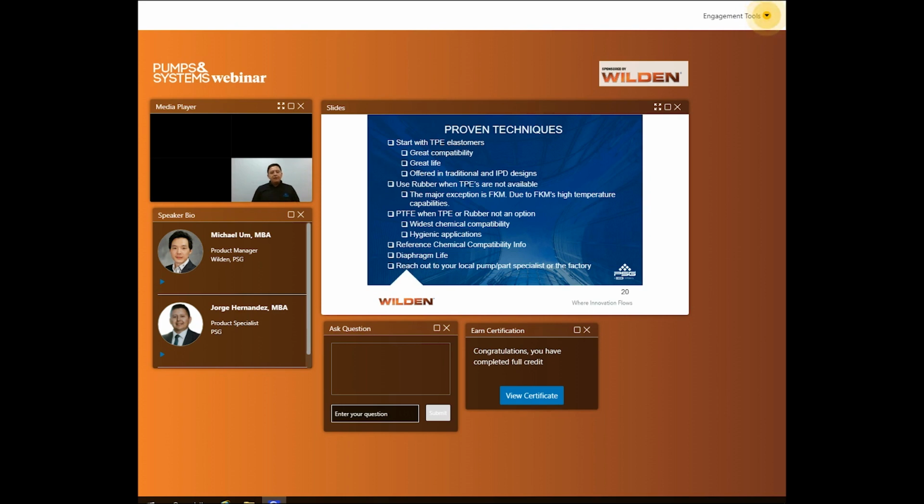The PTFE, you would generally choose when TPE or rubber elastomers are not an option. PTFE will give you the widest chemical compatibility, in case you're not sure what kind of media you're working with, like proprietary liquids, and then also hygienic applications. These hygienic applications would require a PTFE.